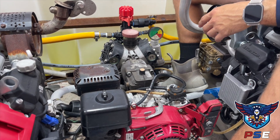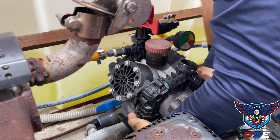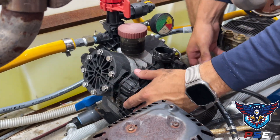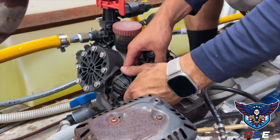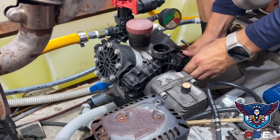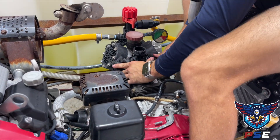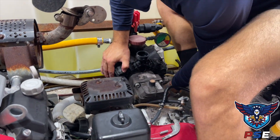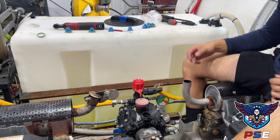Now that the check valves are in, we're going to reinstall the manifold. This part can be irritating because pieces will move side to side, so make sure everything is seated and you're not damaging anything. Once connected, turn the pieces so they're level with the pump heads. You may have to pull it off a couple times to get it aligned. Use the top two to get your alignment set, as the bottom one is more than likely going to be off. Then we're going to do the last fun part — getting the bottom bolts in place.